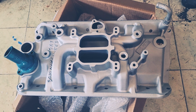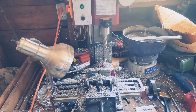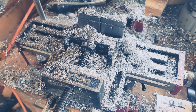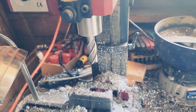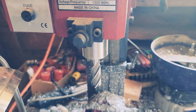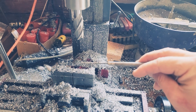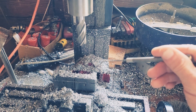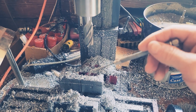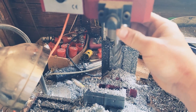But for today, I'll be working on this Harbor Freight mini mill. I was making some freedom chips last night. I had the 11/16ths mill going. When I went to clean out some of the chips, I used this dental tool — bad idea as you can imagine. I didn't turn the machine off. I was in there scraping away some of the chips and got it caught in the mill and sheared off the drive pin.